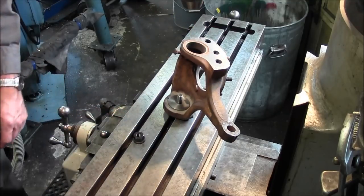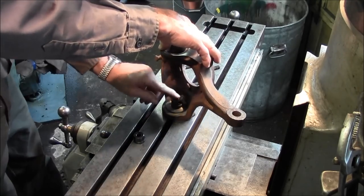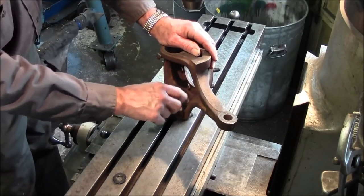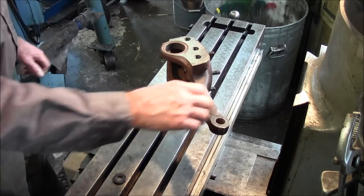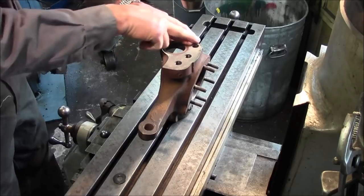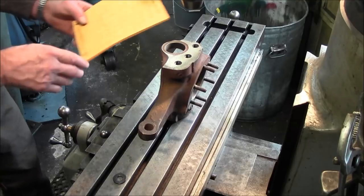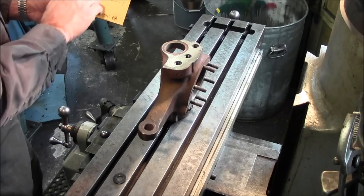So we're going to go ahead and grab us some washer shims here. That ought to be enough, just so that we can take up that difference there. And we're using the flange nut because we know we want a good stout nut there. Now we'll be able to rotate this until we get these two studs right here in a straight line, because that is a known flat. In our drawing, we knew that those two holes are straight across in relationship to the bore.